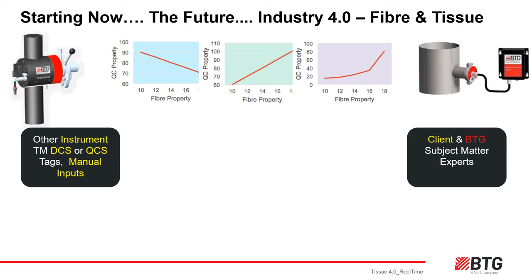If we are able to measure the influencing factors in the wet end before the sheet is formed, we can begin to build a model of how best to do this long before the sheet is formed, scanned and tested. Refiner action, fiber types and blending are long accepted as the fundamentals for achieving sheet quality. Rapid, accurate and repeatable inline testing of fiber morphology, coupled with accurate pre-refiner consistency control, provides a key foundation. With this information and other online results from instrumentation, along with several hundred DCS and QCS tags already at our disposal, we have the collective brain power to make retrospective changes to the process to regain control or make incremental improvements.